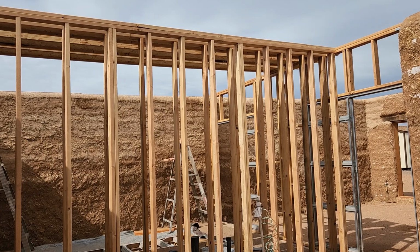So we figured out how to get these i-joists up on top of the roof. We're using the tractor with two fork lift attachments on the bucket. And Dawn made a little jig. I'll show that to you in a little bit. Right now we're putting some up there just to get them up there. And then we're going to flip them up on side, do our 16 on centers, and get them attached.